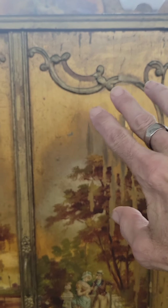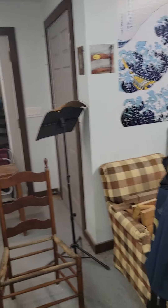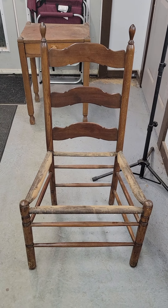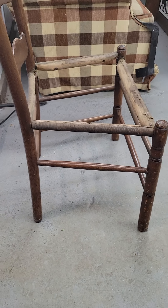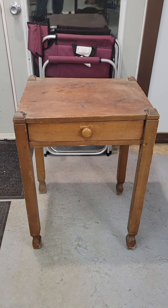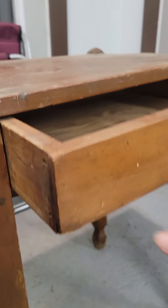This piece here is very interesting — it's a painted piece. My client's great-grandmother was in the USO, and she got this while in Europe. It's got peeling paint and issues like that, but I've done the casework and got it nice and tight again. We're going to brush the loose paint off and just encapsulate it with one or two coats of shellac to keep it as-is. After I replace all the missing carving — 19 pieces to fix — I'll repaint them so it all blends.